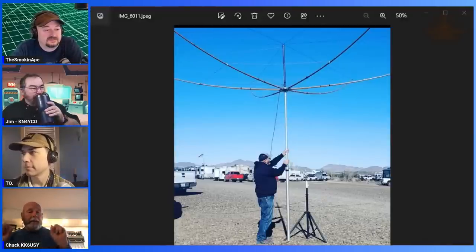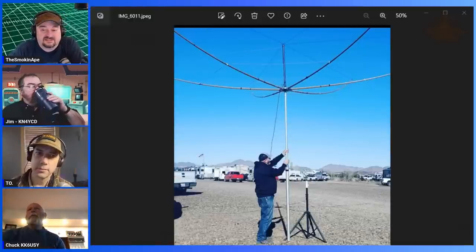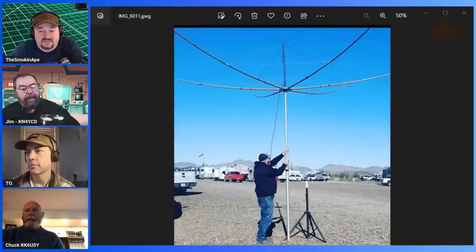I did test our antenna that you and I have been working on. Oh yeah, how did it work out? It's weird. 40 was totally usable according to the radio, even though I was having a problem with 40. It's a different ground too, but it worked good. It wasn't real strong into San Diego, but those guys were strong. It may not be quite as good on 40, but 10 is like the whole band is under 1.5. I mean, the whole band. Sweet. Awesome. I've never seen one do that. Usually it's in the upper end, you know, on a half wave. Right.